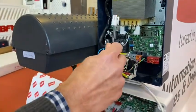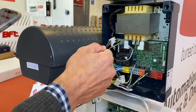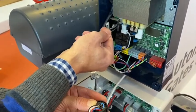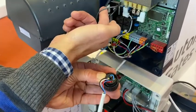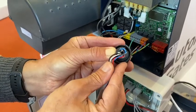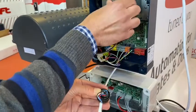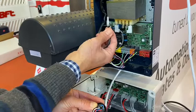On this grey and black cable, it's important that the grey cable that comes off the control board goes into pin number one and the black cable goes onto the earth side of the round plug. The black lead — extend that to the earth side of your round plug. The grey lead off your control board — extend that to number one on the round plug, then put your link in between two and three. All four spots on your round plug will be used by a cable of some sort. Disconnect your grey and black lead off the transformer, and leave the other end connected onto the control board.